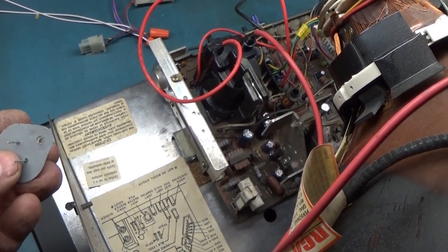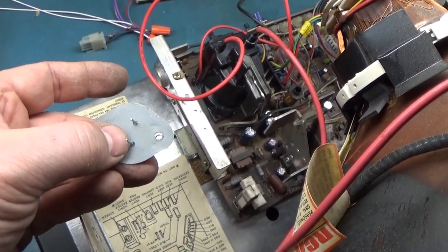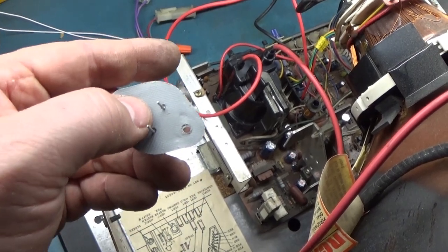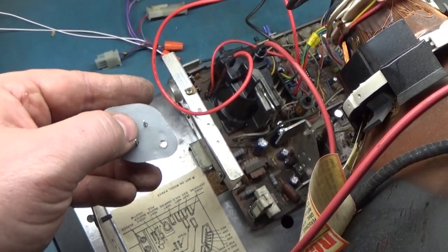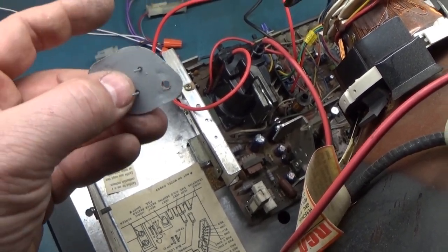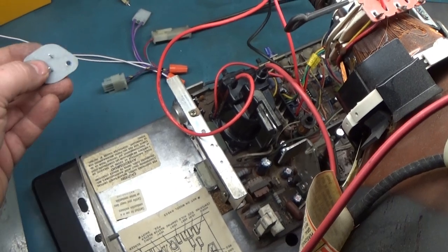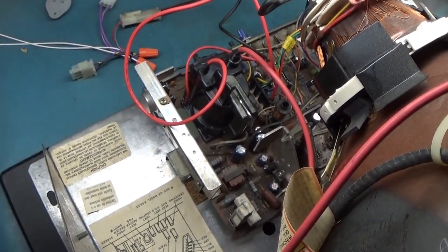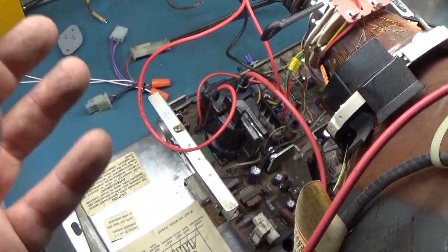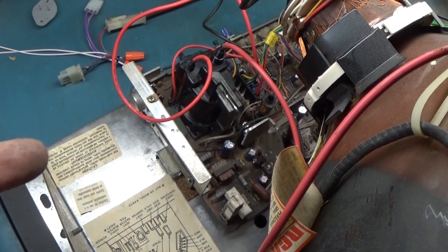And I'm just flabbergasted because it was described to me as the voltage regulator arcing, not the HOT. I didn't discover this until I got to my wit's end with checking and double checking and triple checking everything else that I took this out and discovered, oh, wait a minute, it's the HOT that's arcing, not the voltage regulator. So this had arced itself through the insulator and was causing all my problems. By now, I've got all of the solder joints reflowed, repaired, fixed, new HOT, new voltage regulator, new insulators, new flyback.